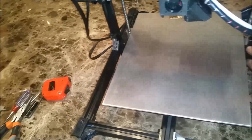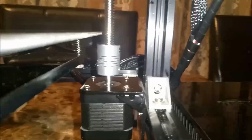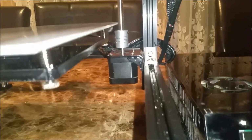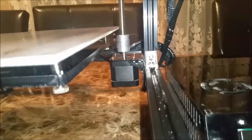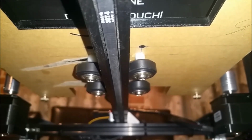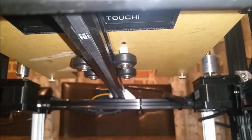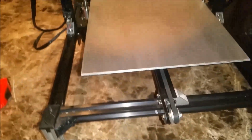I dropped my stepper motors here so that I could get clearance here. Let me take you here on a little tour so you see that. Otherwise I wouldn't have that clearance. Dropped those down by a little over about 22 millimeter. That was enough so that I still have adjustment on my bed. Did that to both sides. They're both down just as far. It's just one side happens to have the screws for the springs tightened a little more than the other right now. And then we modified our acrylic plate, so we moved our holes, and that gave us another 30 millimeter there. Plus we already had a wasted 30 millimeter to begin with, so the two of those together gave me over 60. So I got an extra 65.